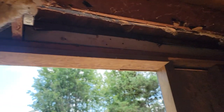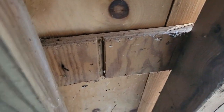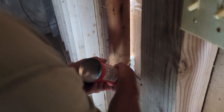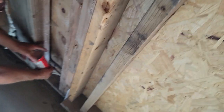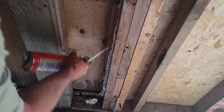We're going to go around any little gaps with spray foam — up there, hit the bottom, come all the way around. I want to do a light coat. This section is built out and he didn't want me to tear that off, so there's no sheathing there. It's out farther, so we're going to spray foam it. I can see a little light there and we're going to spray foam all this stuff. Little air gaps — this is going to be tighter before he starts insulating.